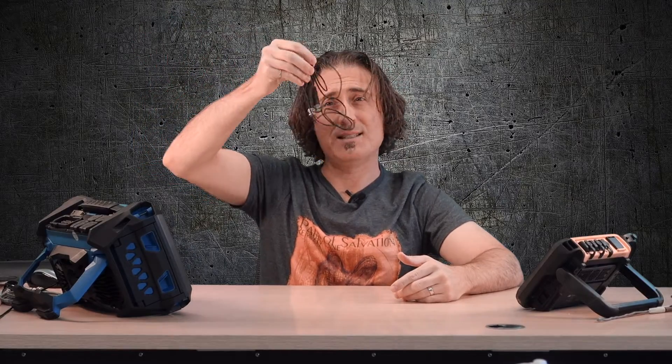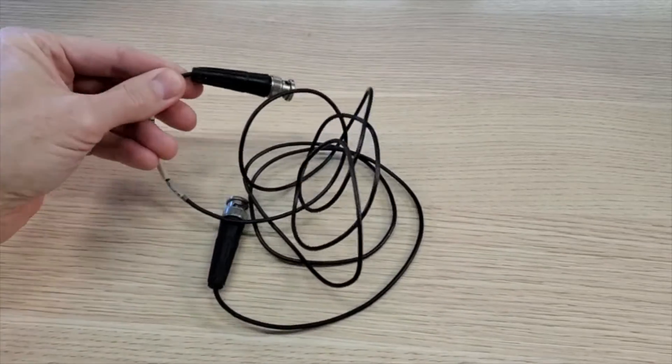If you're like me and you do UT at low temperatures, you know you've got to dress warm, and inevitably you're going to have to deal with the frozen, tangly bits of your UT equipment. Your standard UT cable looks like this. For most of the year this will do the trick, however when the temperature drops, that sheathing gets stiff, the cable has a bit of a memory, and things can get messy.